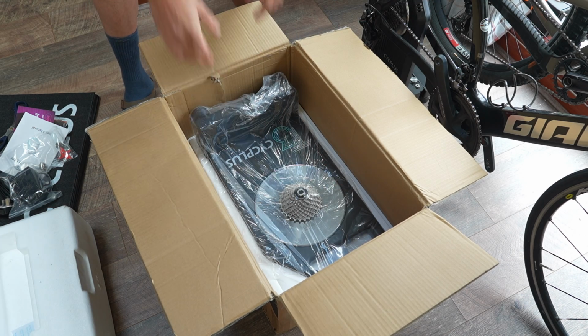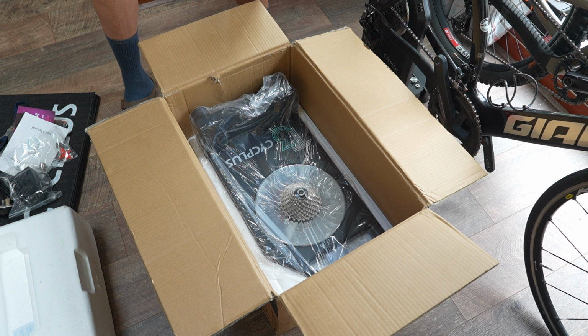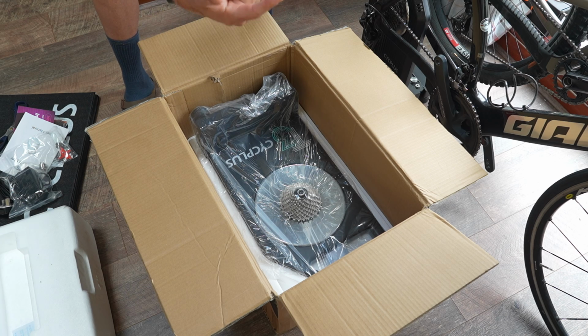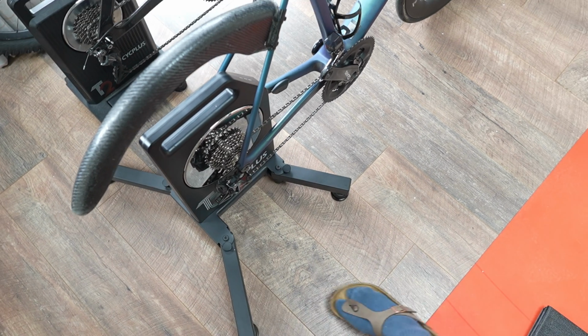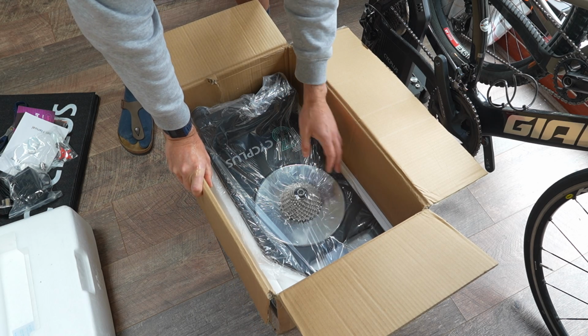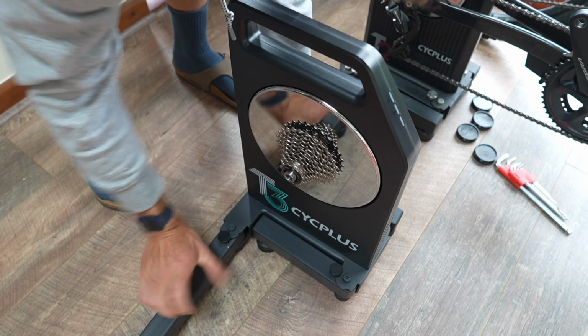So if you've got a direct drive trainer like this, all the braking torque by the magnets has to be done on this. It isn't geared up like the belt-driven flywheel type trainers, which I actually quite like. But the problem with the belt drive trainers is they tend to be quite noisy, and they're actually more expensive to make because of the belt drive increasing the gear ratio. I think it's probably about 4 or 5 to 1 with the belt drive trainers. The flywheel on that small rotor has to be super well balanced, otherwise you're going to get a lot of vibration and noise. You've got the additional belt wear. China is the place for brushless DC motors, so get rid of all the belts, get rid of all the pulleys, and just use a massive BLDC motor.